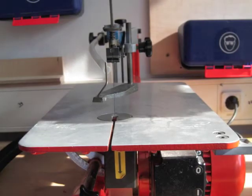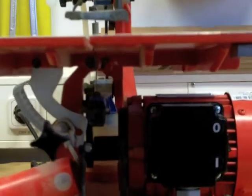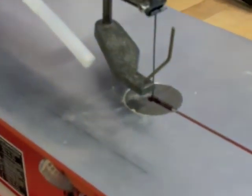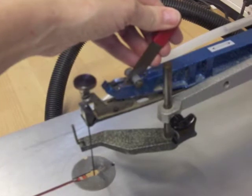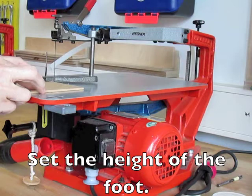Let's start looking at the scroll saw. Before you can start cutting, you have to first check the surface above the table as well as below the table to make sure everything is ready. Firstly, push the blade guard upwards to open the extractor intake underneath the table. Above the table, check that the extractor is pointing in the right position, close to where you are going to be working.